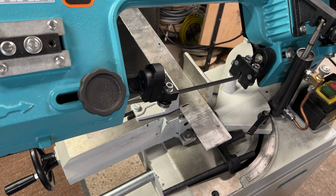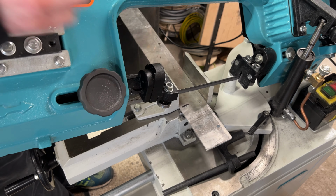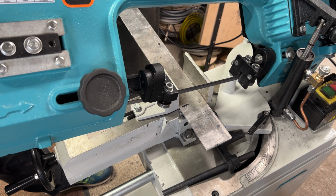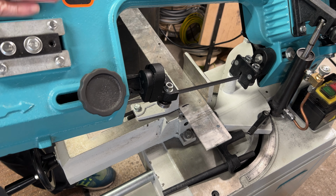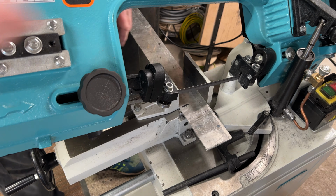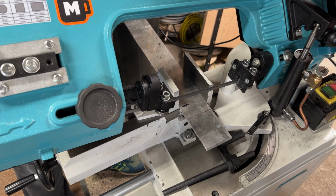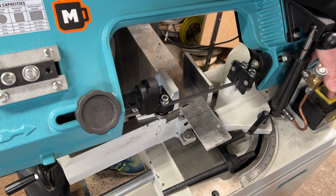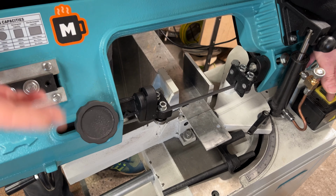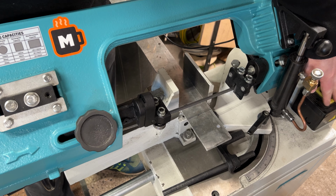Right, I've had a little measure up, and I'll need a strip of aluminium to mount on the studs, about 480 millimeters long. So I'm going to use the old Axminster bandsaw. I wish I bought this years ago. I won't say I use it every day, but it gets more and more use, it really does. So I'm very happy with it. I'll put a link in the description to it, but we'll let it do its work. There's lots of other ways of cutting this, with angle grinder, plain hacksaw. But this will do it fairly squarely, quietly, and I can drink my tea while it's doing it.